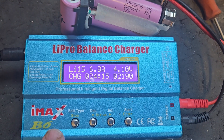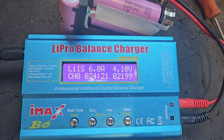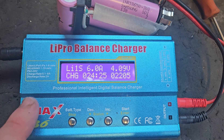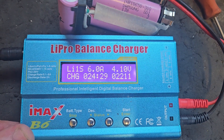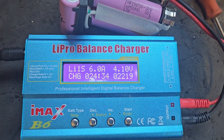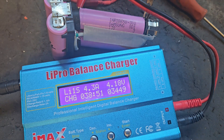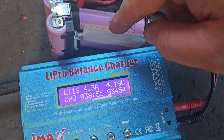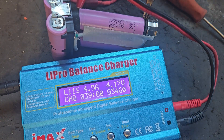If you do want to do this job yourself, this is a very handy tool — the IMAX B6 — and they're not very expensive. If you're doing a few batteries or have a lot of batteries, it will be useful. I'm going to put a link in the description and pinned in the comments section of this video. You know you're coming near capacity when you see the amperage going into the cell starting to drop — that means it's really coming towards where it needs to be.